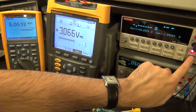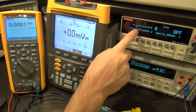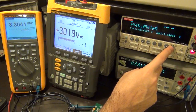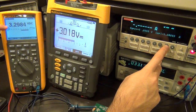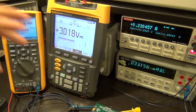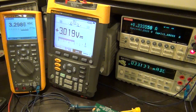Let me reduce the output voltage to 3.3 volts. Now the input voltage is supposed to exceed the output voltage. And you can see I'm getting perfectly 3.3 volts even though the input voltage is larger. I can change the input voltage by 1 volt at a time: 5 volts, 4 volts, 3 volts - now it's below this. 2 volts, 1 volt - below this again. I can go back up: 2, 3, 4, above 5 volts, no problem. This demonstrates something really important: if you have a solar panel connected to this, the output voltage can change greatly depending on sunlight conditions - it can go above or below your regulation voltage and you will always get your constant voltage out.